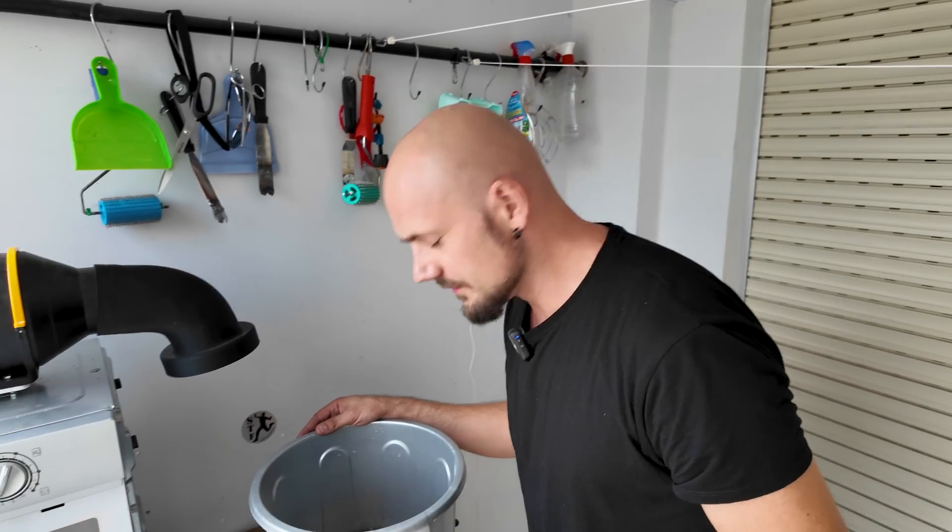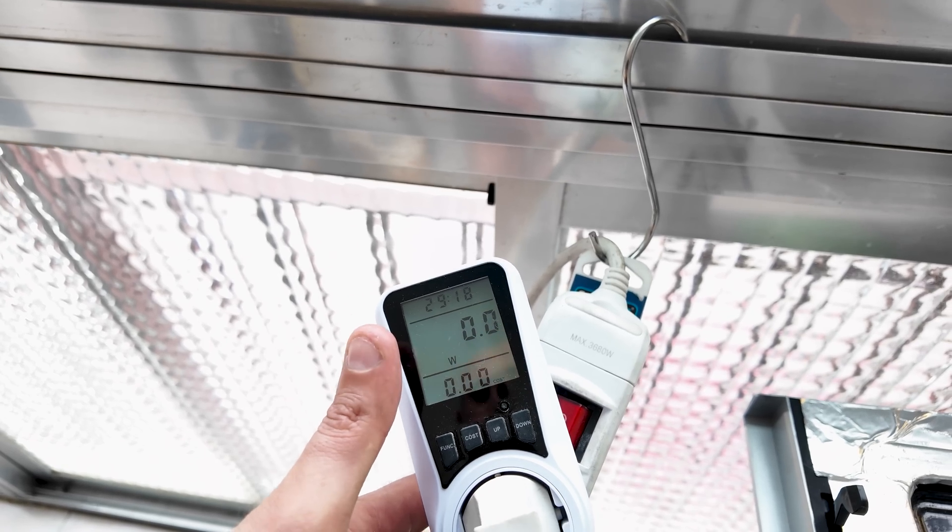But why? The mold was just bad. I didn't mix the plaster well, and I suspect that when I first filled it I didn't have enough, then mixed another batch and poured it on top — it just didn't bond together properly, and that's probably the part that came loose. Even though the cast was a failure, we have all the data.